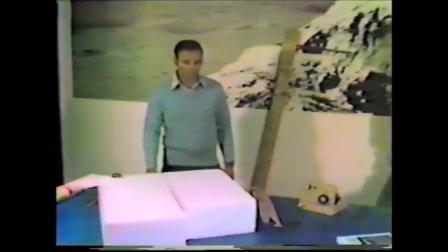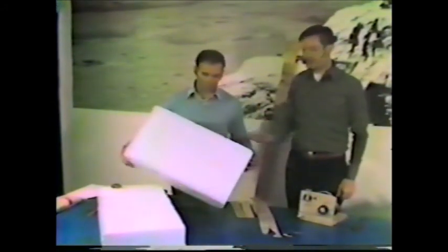The cores for the sandwich structure for flying surfaces are made out of styrofoam and are hot-wire cut to shape. As part of our demonstration we'll be making an actual part for a Long-EZ aircraft — the lower part of the vertical fin. These are the large styrofoam blocks as received: rigid foam, relatively low density, the core for all flying surfaces. Other items on the table are tools for the hot-wiring job, including bags of lead shot to hold the blocks down firmly.